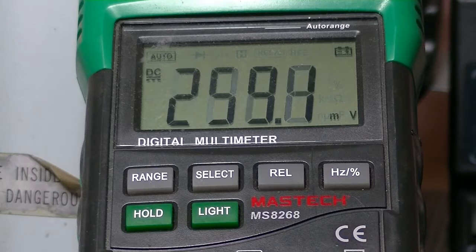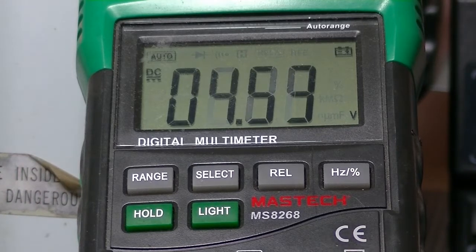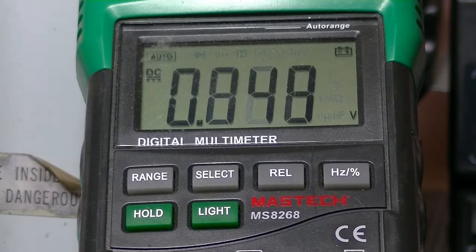So I guess the longer I keep it running, maybe for that 12.4 hours, it'll be fully reformed. But I'm happy with the way it's progressing, and I'm going to up the voltage from 160 to about 175, I think. There we go. And we'll just go through this process all over again. I expect, at least, again, it's all consistent. Raise the voltage, the multimeter registers high voltage running through it, and that's just dropping down. And we'll leave it again for probably 20 minutes, I would say.